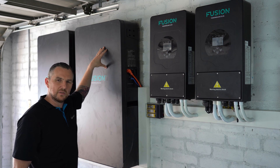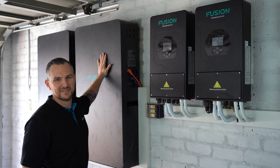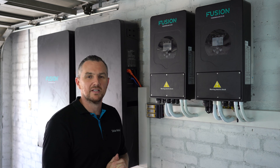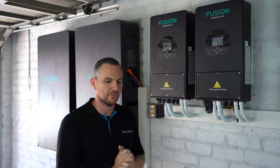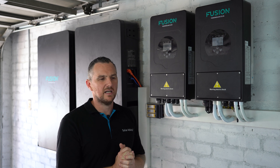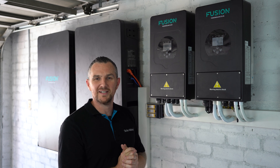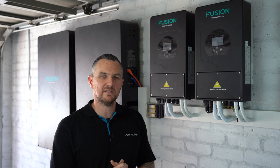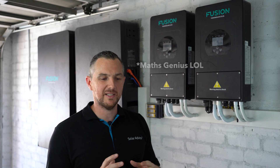Eventually what I'm going to do is swap out my 3.6 kilowatt-hour batteries for 4.8 kilowatt-hour ones — we don't have stock yet so I have to be patient. That's the plan for the next iteration of the system. Next I've got quite a massive solar array on my roof. I recently increased the number of panels to 26 panels in total — they are 410 watt panels. Doing the math, that's about 10.6 kilowatts of PV array. I started with 16 panels, which was 16 times 410 — a 6.5 kilowatt array.